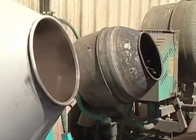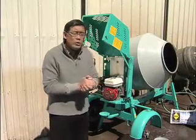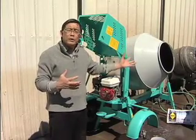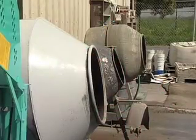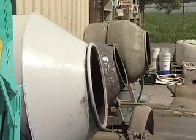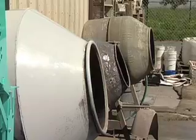With a 3 cubic foot, you may only want to use two bags. So when you go to your local rental yard, they usually have about a 12 cubic foot or a 9 cubic foot. Figure that you're going to be mixing 6 to 7 cubic feet with a 12, and with a 9, maybe you're down to 5 cubic feet.